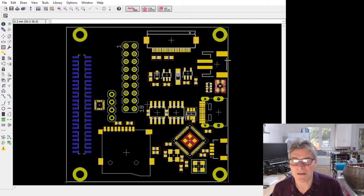That will connect over I squared C, because you'd need that obviously. The other thing that I've got here is a battery connector. You may need to upgrade that, and a battery charger, an RGB LED possibly. And then the other thing that I've added down here is the ESP32, so that we can run CircuitPython on here and script it as well. That in turn can talk directly to the FPGA, gets wired into the FPGA as well, to be able to act as a remote communication device.